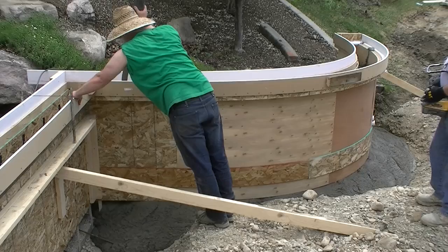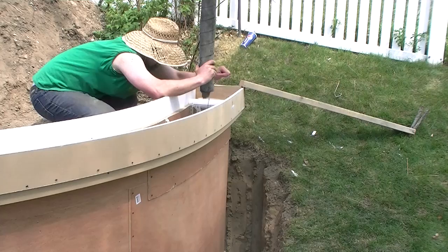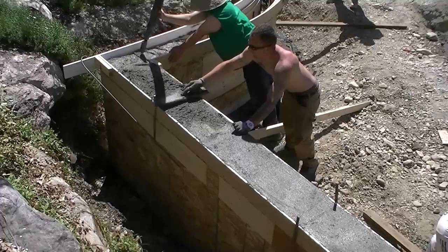As you see, if you get the proper mix design, the concrete will actually flow underneath the wall and will not spill out and go up higher. If the job is big enough, the first pour can be much stiffer than the second. With the proper mix design, concrete will only flow a certain distance horizontally. In some places, we put an exterior form board up for the footing so that the concrete wouldn't go any farther. In all cases, you'll want to consolidate the concrete using a vibrator or tapping the exterior. This step eliminates any voids or honeycomb.